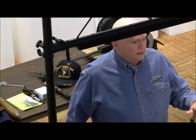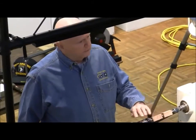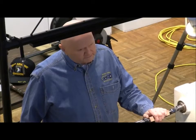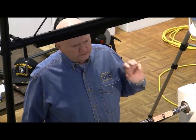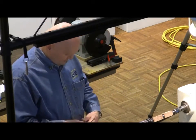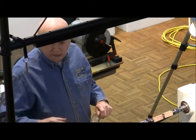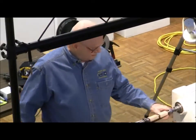With a pen, and doing a pen blank up there. Pen blanks should be done with a roughing gouge and a skew only. And we'll go through this one time, and the skew is just the tool of choice. So let me round this up for us and we'll get going here. Then we'll come back and we'll do some beads and coves. And alrighty, turn this puppy on.